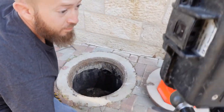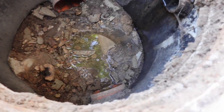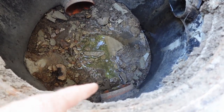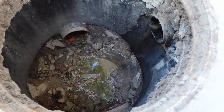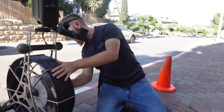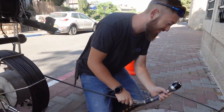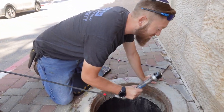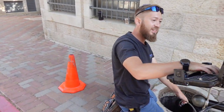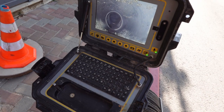There we go. How I know it's a rain drain manhole - you can see on the bottom there's no trough or sides on it. The bench comes in and goes out. That wouldn't be sewage. You gotta keep the lens clean, otherwise it's gonna be foggy and it doesn't work. So we've got what looks like two 45-degree bends, which is gonna make it easier for us to go up.